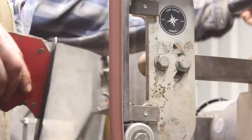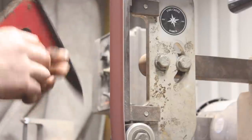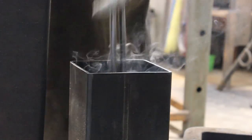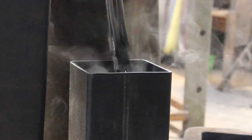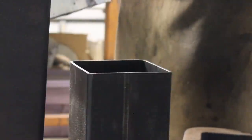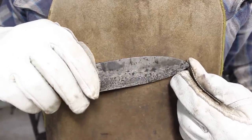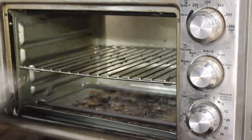Before the last thermocycle, I went ahead and ground things flat — got everything more or less even in thickness, accounting for the tapered tang and distal taper — just taking any lumps off. This knife I'm planning to use buffalo horn scales, and some 3/32-inch thick nickel silver pins will go real nicely with the buffalo horn. I kind of like to do multiple pins in a pattern — it's sort of historical; I've seen antique original knives with similar handle work, so it's inspired by that. We're going to have a bunch of pins in this handle — it's obviously going to hold it on there real well and it's going to look really cool. We're out of the quench — everything held together just fine, no cracks, no separations, no delaminations. You can already start to see some of the pattern, and I think this is going to look pretty cool on the finished project. Stay tuned for part two coming soon.